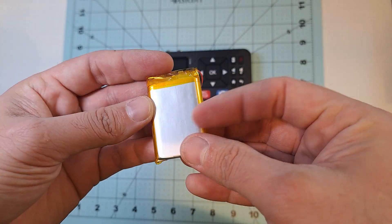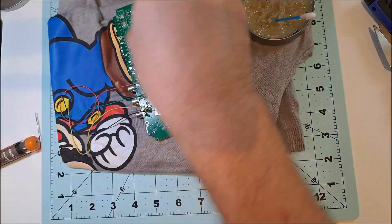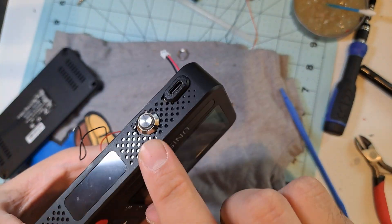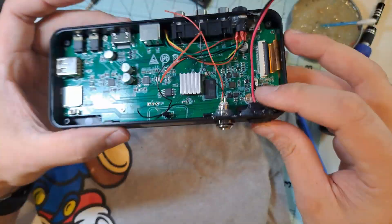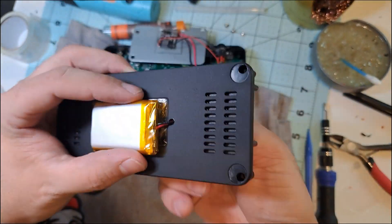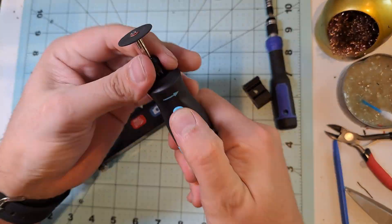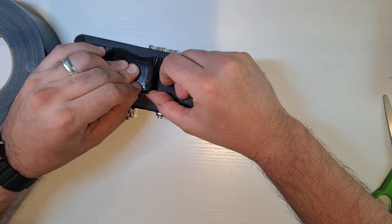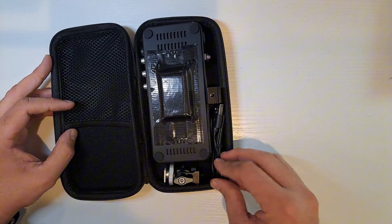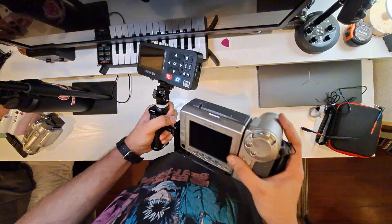Number 1: Materials — I'll leave links in the description. Number 2: Installing a 3.5mm AV input, a more compact connector that lets me use a small cable instead of bulky RCA cables. Number 3: Adding a power button and USB-C extender for easier charging access. Number 4: Installing a USB-C charging module to power the new battery. Number 5: Adding a rechargeable battery to make it fully portable. Number 6: Mounting a cold shoe adapter so it can be attached to a monitor mount or a one-quarter thread. Number 7: Battery protection and screen glass protector for extra durability. Number 8: Finding a case for it, because you gotta keep it safe. And Number 9: Final setup and testing — let's see how it performs with different cameras and setups.